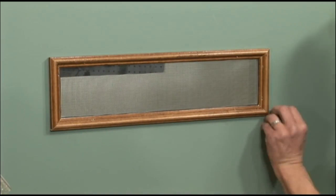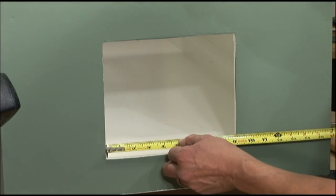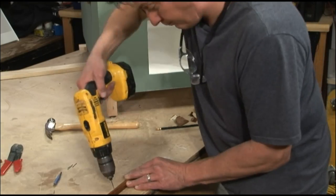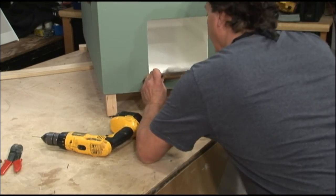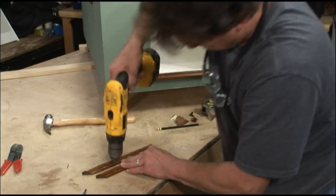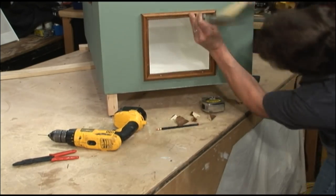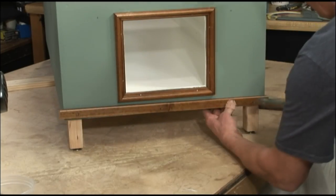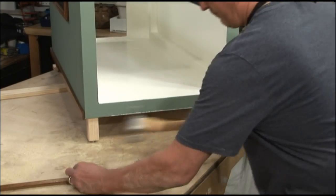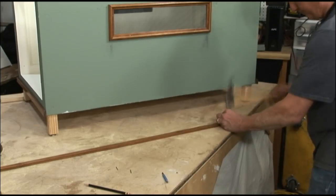At times you may need to put a nail in the corners to lock them up. The entrance measures 9 inches by 7⅞ inches. Always take the time to cut your pieces with accuracy — measure twice, cut once. After the trim is installed, you should have a nice snug fit. Don't worry if you nick up the green paint — you can always go back and touch it up. The wood trim gives the project a nice traditional look. After all the pieces are in, go back with a nail punch and send those nails home. With the base molding, we can use the full six-penny nail since we're going into more wood — it won't stick out on the other side. Make sure all your corners are real tight.